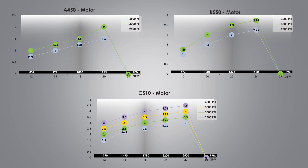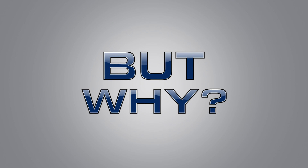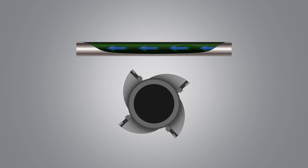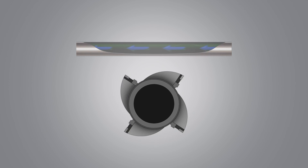That's quite a range of performance. But why? To understand, let's look at the differences in how the hydraulic motors work. A and B series motors mainly make use of flow to produce their cutting power — as the flow increases, so does the mulching capacity.